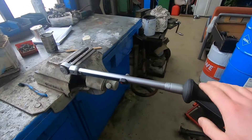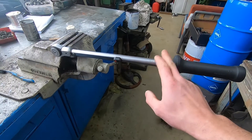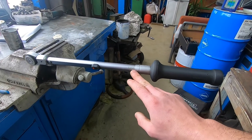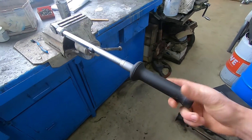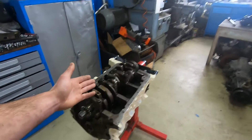Keep in mind that this measurement doesn't confirm that the torque wrench is accurate across the whole measuring range, but we did confirm that it is pretty accurate at our value of 100 newton meters. And in order to keep your torque wrench accurate in the long run, you should always release it all the way to zero when you're done using it. So there you have it — a quick and easy method to check your torque wrench so you won't be breaking bolts or under-torquing things. Now that I've got my torque wrench checked, I'll happily carry on with my engine assembly. That's it for today — if you like this kind of content, make sure to like and subscribe, and I'll see you in the next one. Be good.